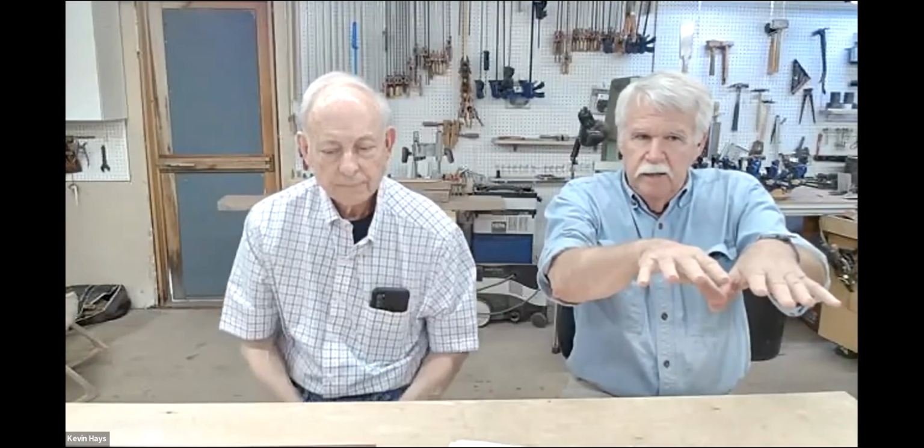Correct. The only real experience I have with thin wood is guitar tops, and the tops are usually about 3 millimeters. What's that in thousandths? About 100 thousandths of an inch. It's 0.093. So we have to worry about the wood movement. That's why most guitar tops have a slight bow to them, and that bow is for no other reason than to allow it to expand and contract a little bit, because the bracing on the underside basically does the same thing as your substrate for the plywood. So the bending actually allows the wood to expand and contract a little bit.